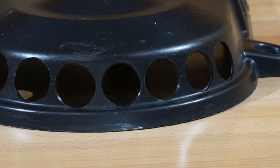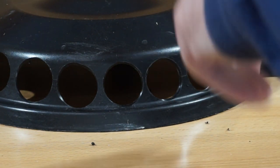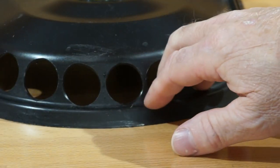We're going to go ahead and put this Big Mama in here. See how close this is? You do not want that — this is for video purposes only. What you do want to do is come to the inside and hit this again with the step drill, just barely — just enough to chamfer that. You do want to hold this step drill bit at 90 degrees. That's how you do that, ladies and gentlemen. For all of you watching who have children — children, you can do this, you can do it for your parents, but get permission first. Don't do it on your own. Ask your parents first.